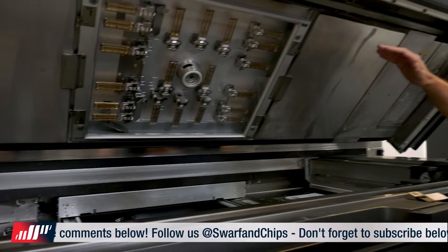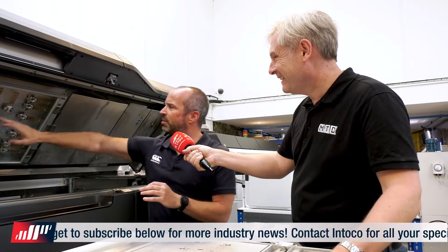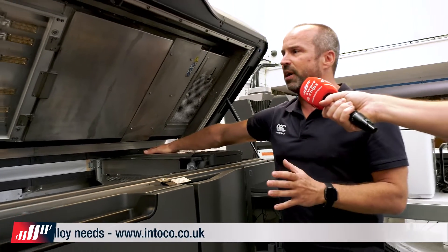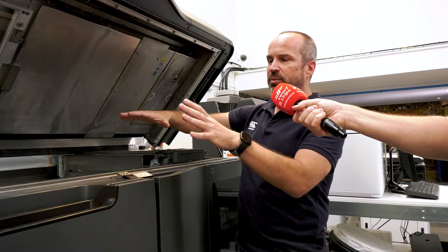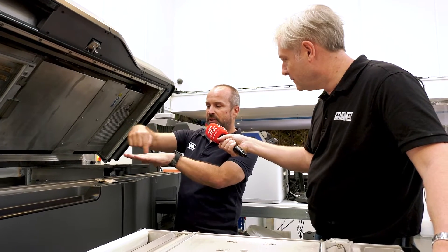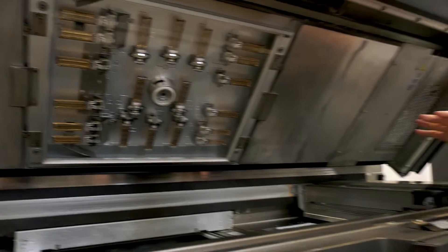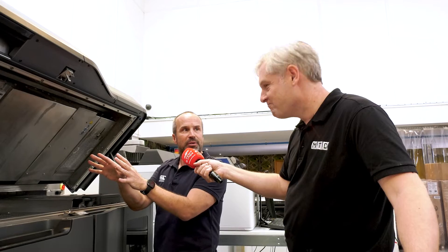What sort of temperature? The nylon's preheated to 168 degrees - or thereabouts, maybe 167, maybe 169. It's pretty accurately controlled by a thermal camera in the middle, and it's kept absolutely just below melting point. Then we've got three print heads, which HP have very cleverly leveraged from their 2D print business. They are super reliable. We've got two fusing lamps. For each slice of the part we're making, you'll have an outline of the part which is solid. The ink comes over, the carriage comes over, and the inkjet will print a black part. It will then print some retardant around the edge known as detailing agent. When these two lamps add that tiny bit more energy, the blackness absorbs a little bit more heat, it melts and becomes part of the part. The detailing agent around the edge acts as a retardant so we don't get over-melt and spread of the melt pool into anywhere else.